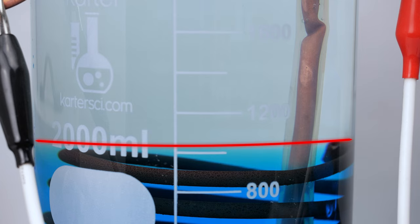The blue layer on bottom has become locally saturated with copper ions, and copper sulfate has started forming crystals over the electrodes. The layer on top is still clear, meaning there are nearly no copper ions there. If I stir up the solution, the top layer will dissolve the crystals and the electrolysis will continue.